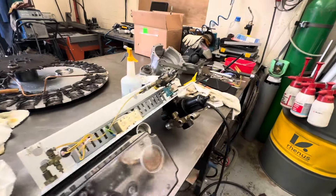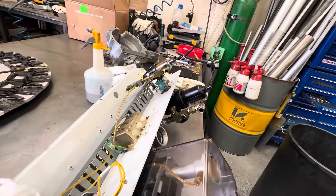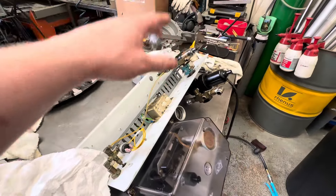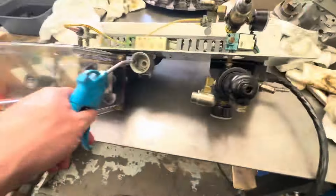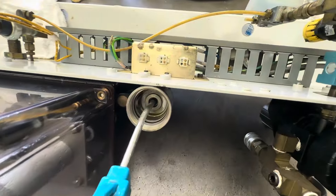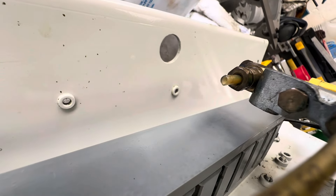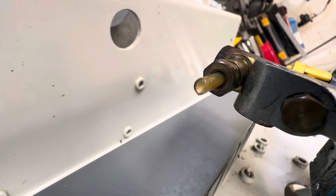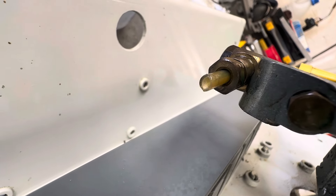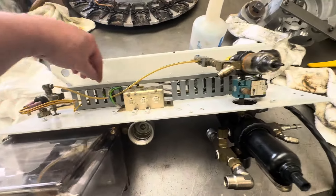They're very expensive to upgrade - I looked into it and it was about two thousand pounds just to do the air oiler setup for the spindle. I suppose it's not expensive in comparison to the cost of a new spindle if you have to buy one, but this does work if you maintain it. I also put air into there so I know this line is clear.